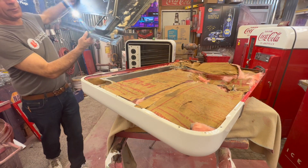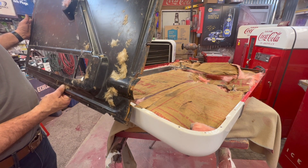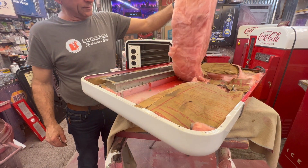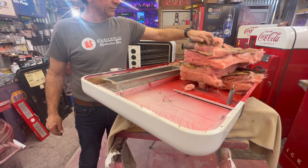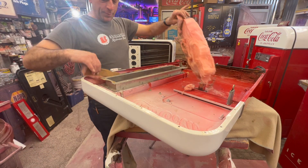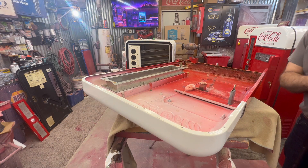And we're out. Look at that bottom liner - there's your issue. I could save that if I wanted to - I could re-fiberglass that bottom, drill new holes and it would be good. But we will save it and if a new one is available it will get a new one. The insulation is actually in pretty good shape. I can tell by the pink - it was definitely good 20 years ago, 15 to 20 years. Here's where your rust area was at - not bad, I've seen worse. The upper part of this machine was very nice but it was getting some moisture down there. We'll put some undercoating on it, we'll re-bead blast all this, and save this gasket.